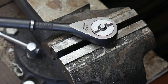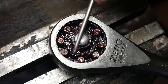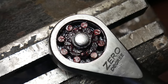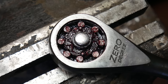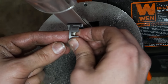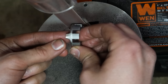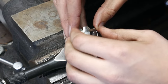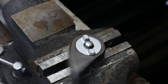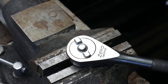At this point, we disassembled the half-inch ratchet again in order to grease it up as well. Even without the cage installed, you can see how this wrench works — as the body of the wrench is rotated, the rollers are jammed up against that tapered edge and lock the whole thing up. Then it occurred to me that since this one doesn't have any shims to make it fit tightly, I think the body of the ratchet is actually rubbing against the switch, and the friction between those two parts is what keeps unlocking that detent. I didn't have any shims the right size, and even if I wanted to cut up a feeler gauge, that wouldn't be quite big enough. So I figured the next best thing would be to make a little more clearance between the switch and the body, and sanded down the outside diameter of the switch. We didn't remove too much steel, just enough to give it a little bit of extra clearance and make sure the surface is nice and smooth and doesn't resist movement. Then we thoroughly cleaned the switch and, for one final time, reassembled the ratchet. It works better now than it ever did, but if you really lift up on the handle, it is still possible to make the whole thing unlock. The best solution would probably be fitting some shims in there, but further sanding the outside of the switch would probably help as well. But honestly, it works pretty well, and it's so much better than before, I don't think it's going to be too much of an issue.